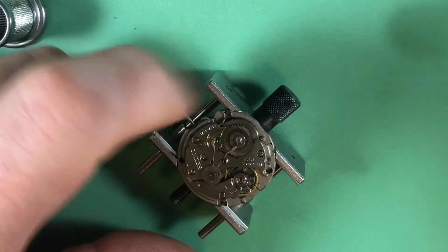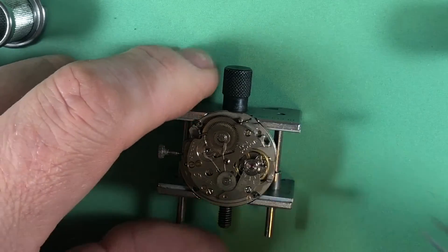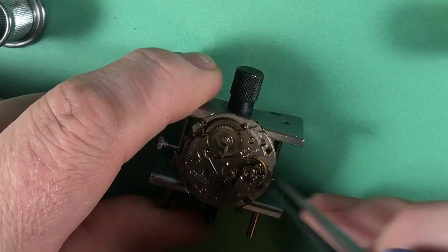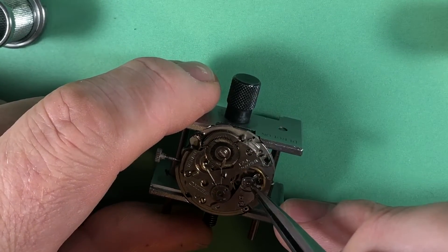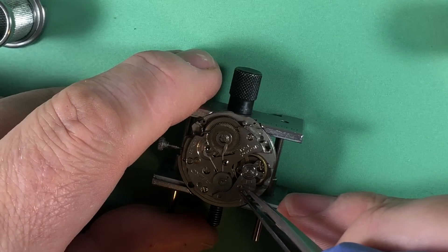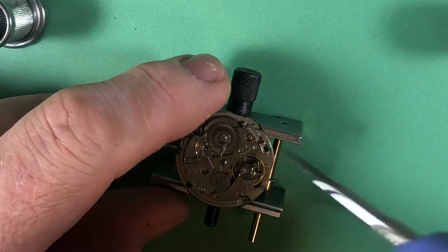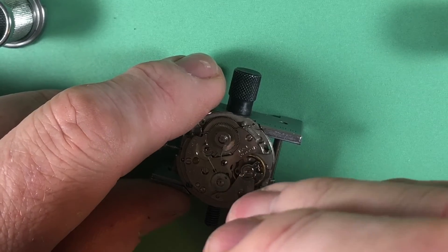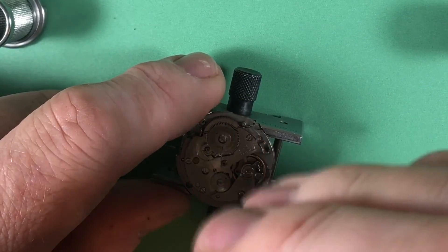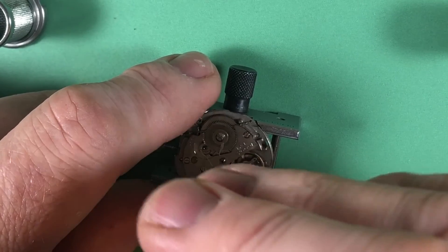It's rare to see a 7000 series with wear like that, but this watch lived a very long working life — a pretty intense one. So we're going to have to do something we don't normally do, which is jewel the lower mainspring arbor and probably repair the upper bushing too, and the train bridge. I actually have those replacement bushings, so that's a good thing.